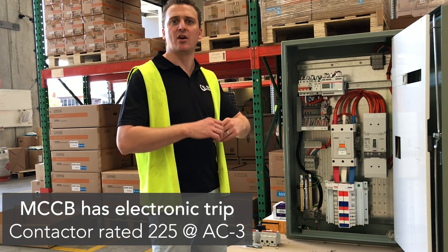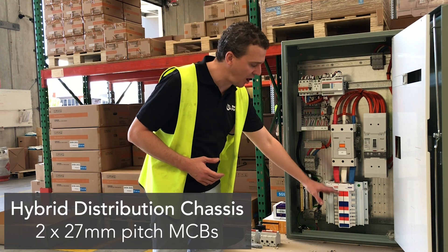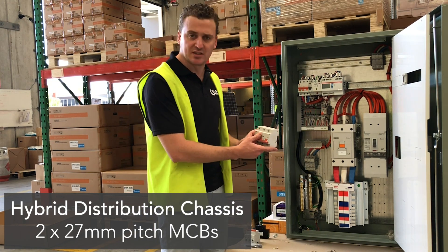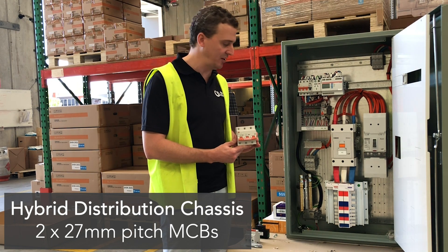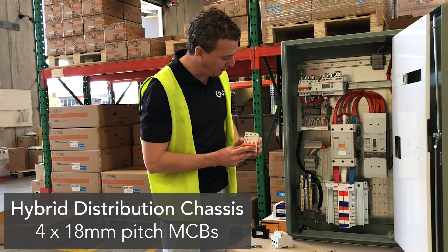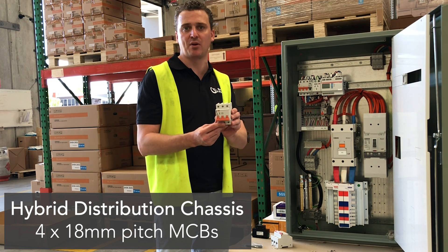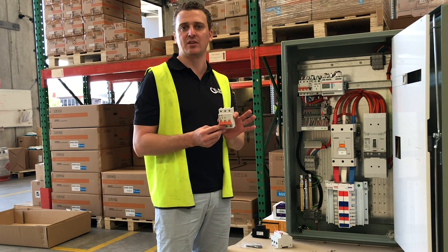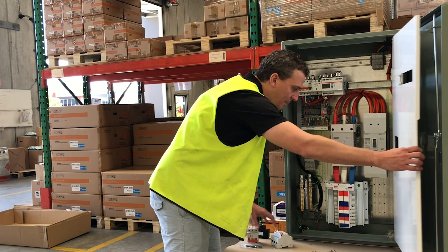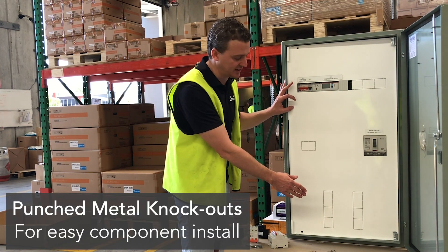What really makes this product unique and great to use is this hybrid chassis down here. With these larger prongs, it gives the ability to put in up to two of the larger breakers which will allow 50 kilowatt inverters. And on these smaller prongs, you can put up to four of the smaller breakers which essentially would allow you to do 20 or 30 kilowatt inverters per breaker. So for example, if you were doing three Eco 27 Fronius inverters, you would clip in three of these, and they have put in proper knockouts as opposed to pole fillers.